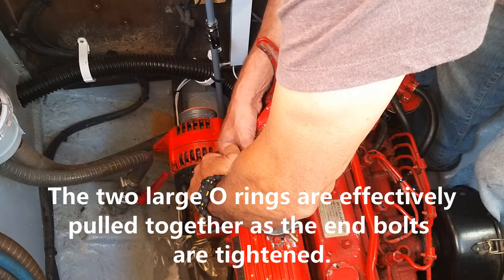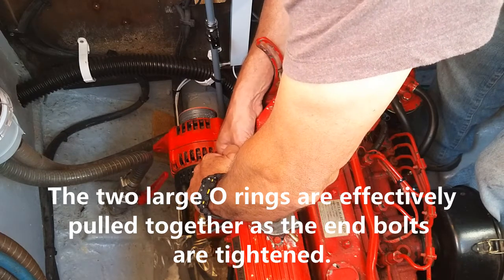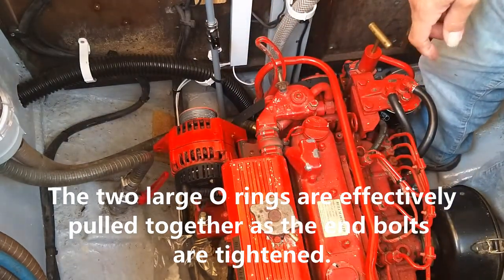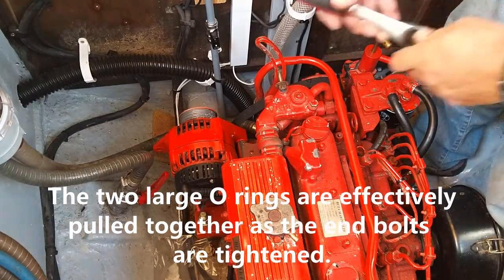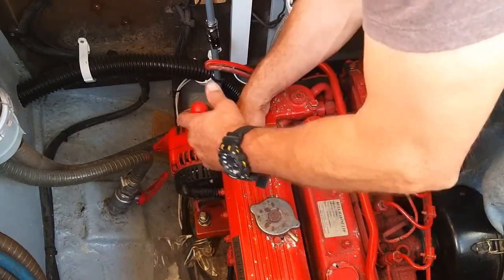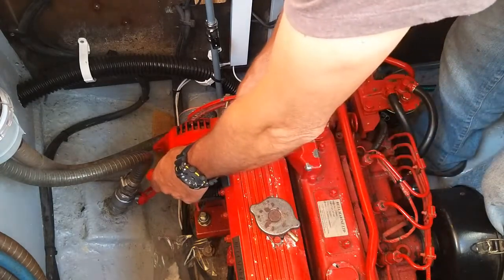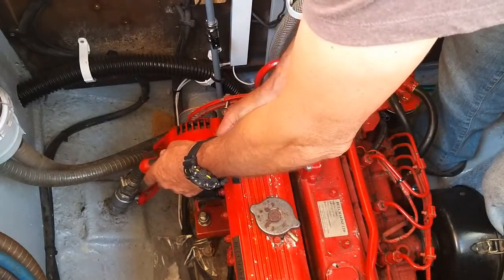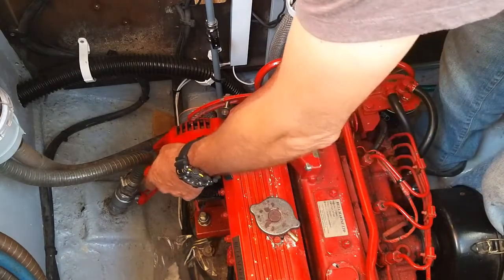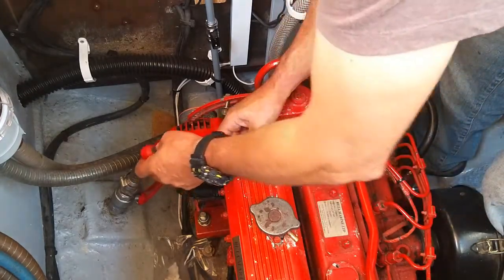You must make sure that that o-ring is seated correctly before putting the end cap on. Now I'm going to slightly tighten that up to get it set. This should not be over-tightened — just take it up to where it starts to feel fairly tight.